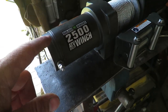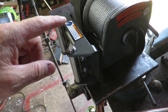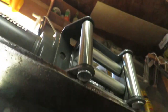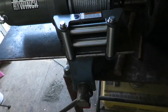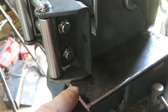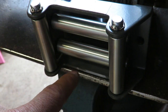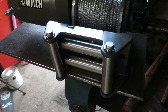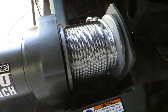We went ahead and got that plate all cleaned up, and I put the winch on top of the plate just to see where I want it. I've got the front guide area — this piece with all the rollers — up in the front. I want to make sure the pins are in front of the plate in case anything ever needs to be changed out. I've already ground down all the paint on the sides of the roller area on both the front and back sides. I'm going to clamp this right here so I know exactly where it's got to go, then I'll tack weld the sides first and then weld up the front and back. Then we can make our marks for the actual winch mounting holes.